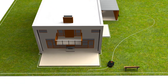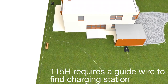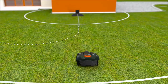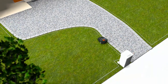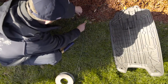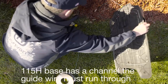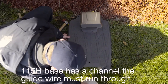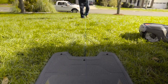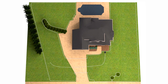The guide wire opens a lot of possibilities. It will help the mower find its way to different and more challenging parts of your lawn and return effortlessly to the charging station. Automower does not require a guide wire as they can also find the station with a radio signal and follow the boundary wire. But we recommend installing it anyway, as the mower will find the charging station faster. In general, the cable should start from the rear of the charging station, leave 2 feet of extra wire, and be placed centered under the base plate. In front of the charging station, lay the wire at least 5 feet in a straight line. Use the staples and continue with the wire until you reach the planned spot for connection to the boundary wire.